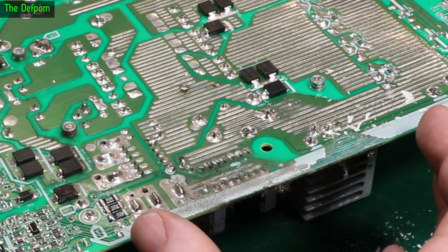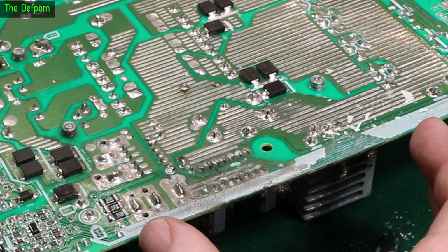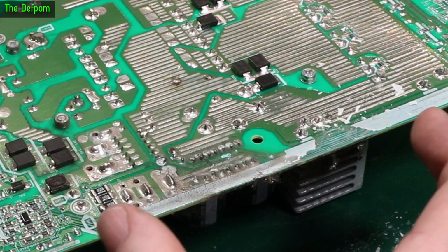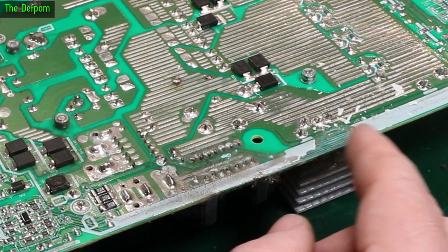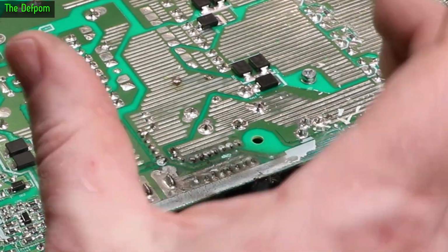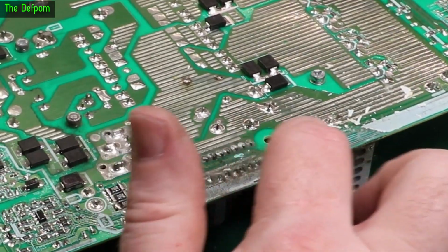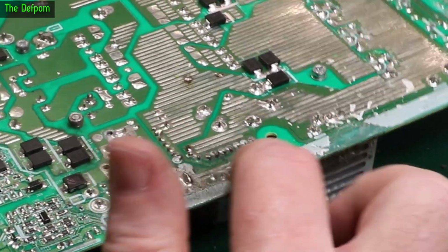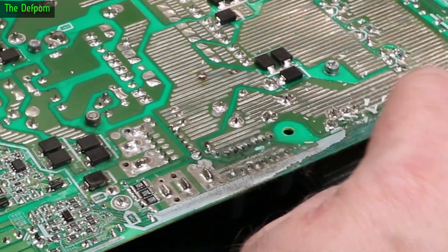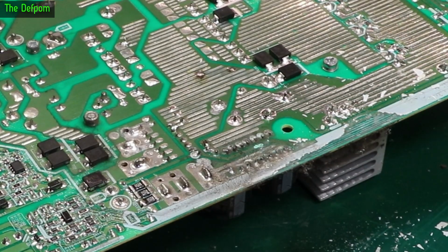Now I repaired another machine recently, a G4 Mac, an old G4 Sawtooth, or was it Gigabit Ethernet, I think it was actually, they all look very similar. They've got a fan right near the circuit board on the power supply, and the fan was throwing junk in, and it actually corroded components right by the fan, and that's what I found in it. So that is in my mind, and as this silk screen is basically flaking away, that makes me think maybe there's something similar going on here, because that's a similar sort of symptom.